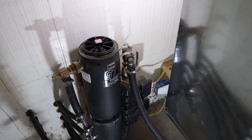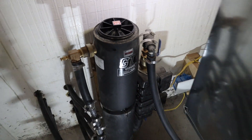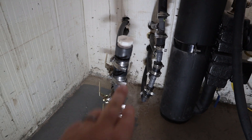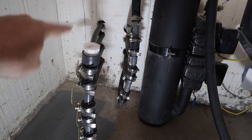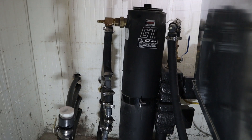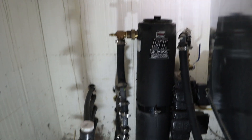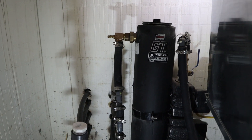Just make sure that the top of your GT Flow Center is at the top of your system. Since it's a non-pressurized system, this top has to be at the top to get all of the air out. Speaking of air — I put a cap right at the top of the system. Its main purpose is to initially fill the system with all of the fluid. Once the lines are filled, you put that cap back in place and resume filling the GT Flow Center, at which point you can cycle on and off to get the rest of the air out. When you do cycle it on and off, don't have the actual heat pump going at the same time — just flip the breaker on for a bit, suck the fluid down, turn it off, add more fluid, and repeat.